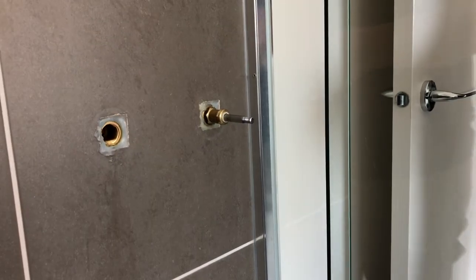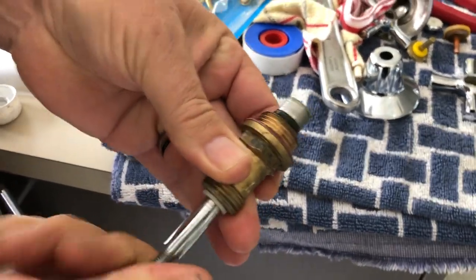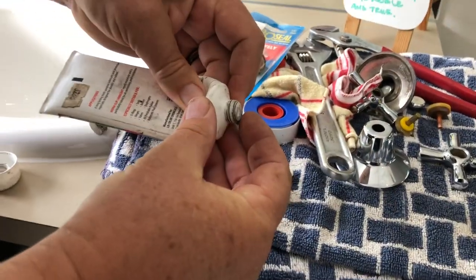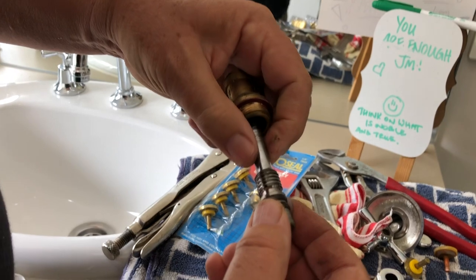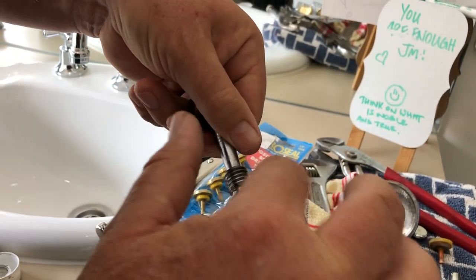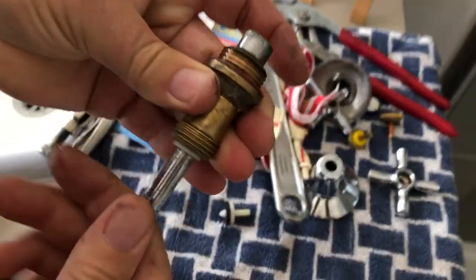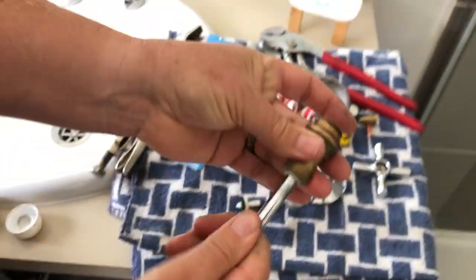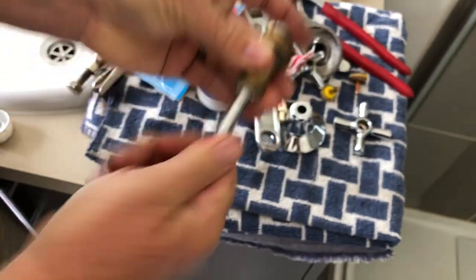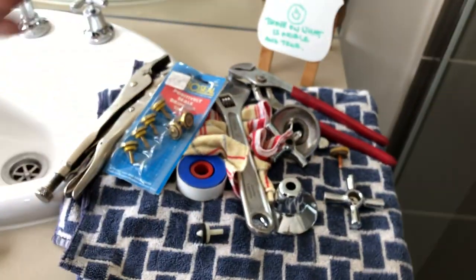The way the tap works: as it turns, you see these o-rings travel inside. So we're going to take the opportunity to put a bit of lube on them. I've got a link in the description to the silicone-based lube you can use - just a tiny little bit, rubbed on both o-rings to make them slide a lot nicer. We're going to put some on the thread as well. The link goes to some food-grade stuff - this is a shower tap so it doesn't have to be food grade, but if you get the food-grade stuff you can use it on the kitchen tap as well. Have it fully open, which is fully back - if you try to install it in the wall with it out you'll end up crushing your new washer.